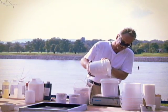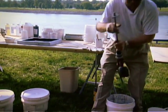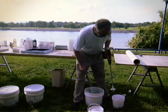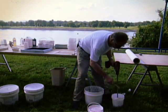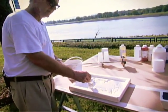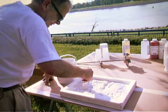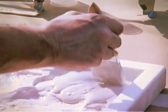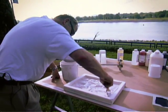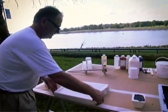Now we've weighed out the full amount of material that we need. Pick up the mixer. When you finish mixing, it's important to wash and keep it clean. Using a dry brush, pour some material into the mold and make sure that you've picked up all of the surface detail, particularly any complex pieces. Don't be afraid to put some energy into it. When you're satisfied that you've got all of the detail and you've been around the edges and into the corners, simply pour and allow to set.